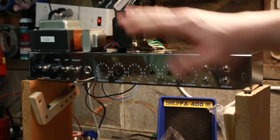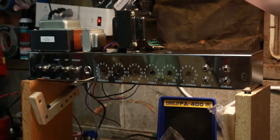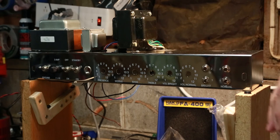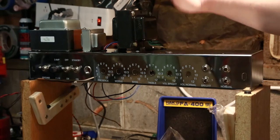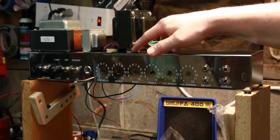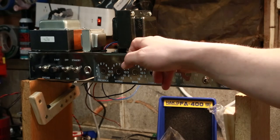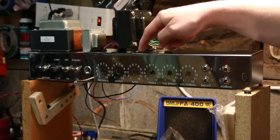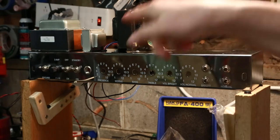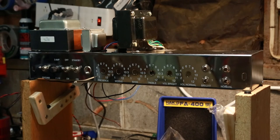I've not done any actual wiring yet but I just wanted to show you the starting point. The rest of this is stuff that anyone should be able to do with a couple of screwdrivers and wrenches. I've attached the power transformer, the choke, and the output transformer. The only tricky part is that this particular output transformer didn't exactly fit the holes designed for it originally, so I had to file back the four mounting feet posts inward slightly on either side so that I could fit them into the chassis holes without having to re-drill the chassis.